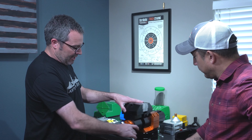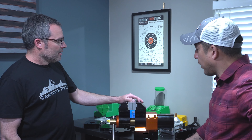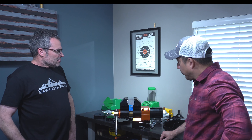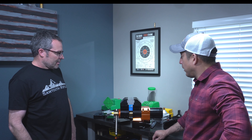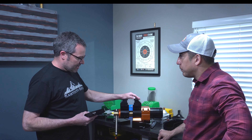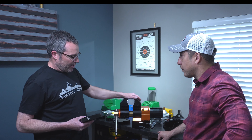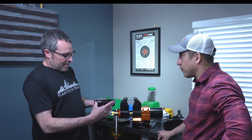Should we show the bench vise as well? Yeah — so you're done reloading your ammo and you need to work on your rifle. The bottom of the Orange bench vise has the pull stud with the same geometry built in, so it clamps right on and you just tighten it down. I didn't have the dowel pin in there, which actually allows it to swivel. If you want it locked, you put the dowel pin in and it won't rotate. But any time you're really using it, you want to torque these down and that'll hold it in place.